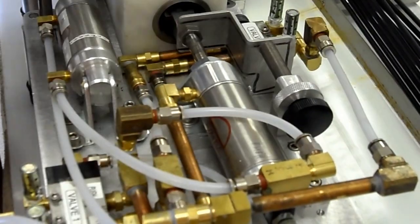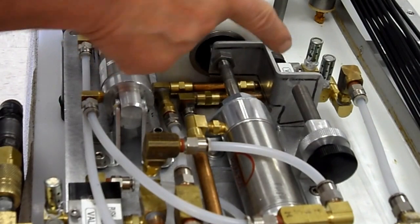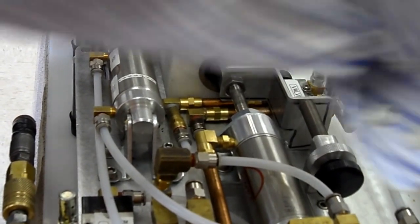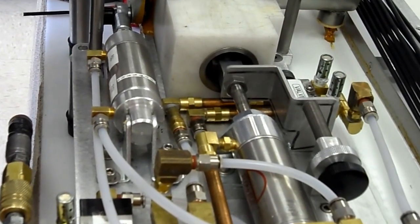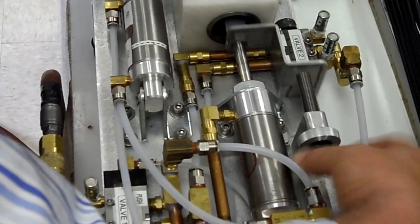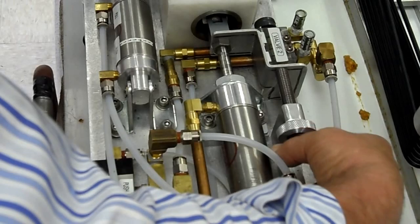Now, you don't want to have it too slow. If I make the time too slow, which I'll bring down to 3, for this particular amount of filling, it would actually work on 2 or maybe even 1. Okay, so it works on 2 or 1. However, if I lengthen the stroke, I'll lengthen it to the point where it's not going to work.